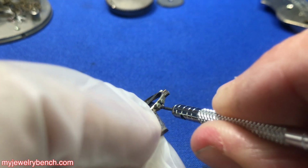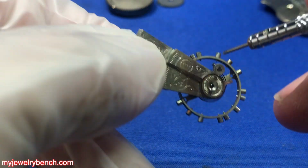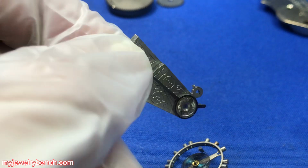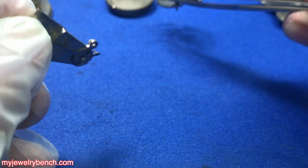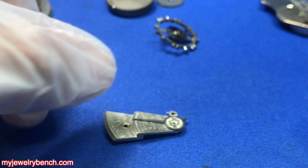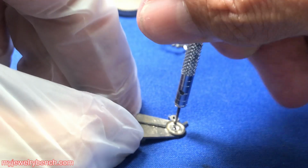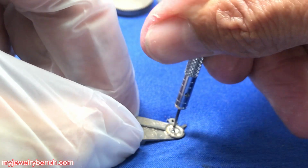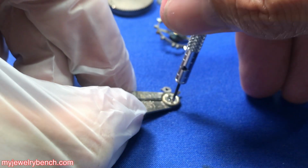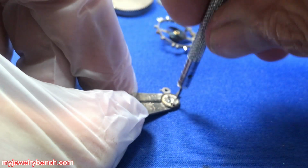Because the watch would run good in the upright position, but face down it would run poorly, I decided to take out the jewels, and you can see here I'm just going to pull those out by releasing the balance wheel from the balance cock, and then we're going to remove those 2 screws there and start working on the jewels. Both the upper and lower jewels here, there's a hole and a cap jewel on each set, were pretty dirty. They were pretty gummy and dried up oil and debris inside. So it was worth cleaning those up, and it made the watch run a whole lot better.